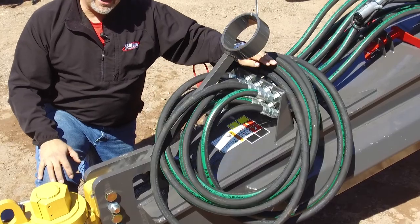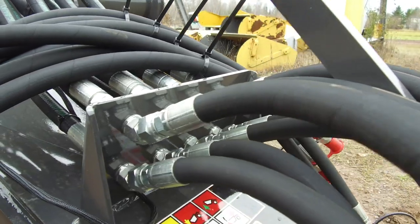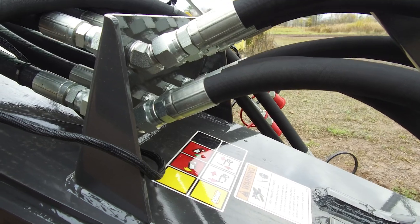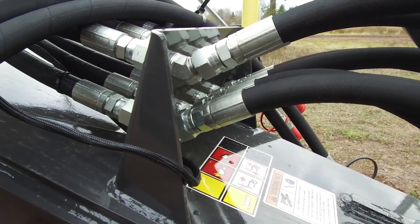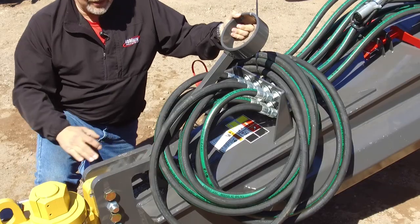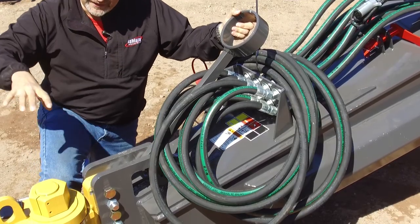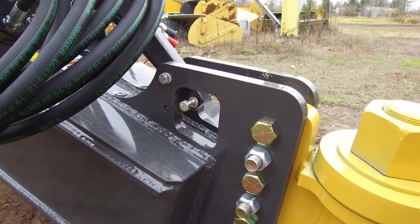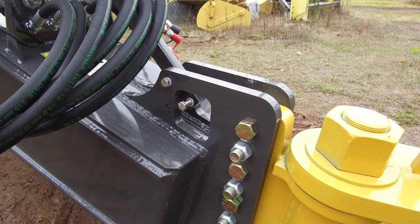The front of the pole gives you protection against damaging your hydraulic lines with a heavy duty steel bulkhead. So if you have a separation between the tractor and the scraper, we don't have to worry about tearing off your hydraulic lines — we have a good hard connecting point. A robust hydraulic hose stand keeps those hoses out of the hitch area in a tight turn situation, and there's also a big passage area for chaining this down onto a truck.